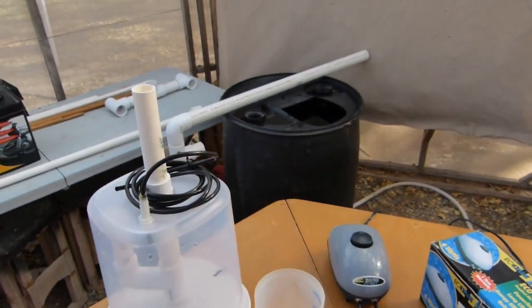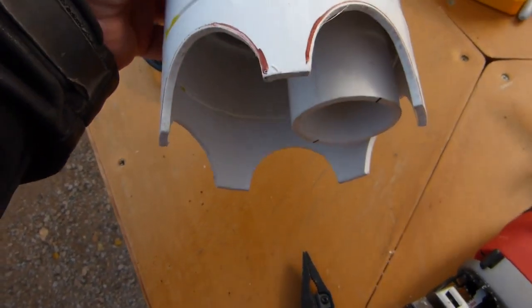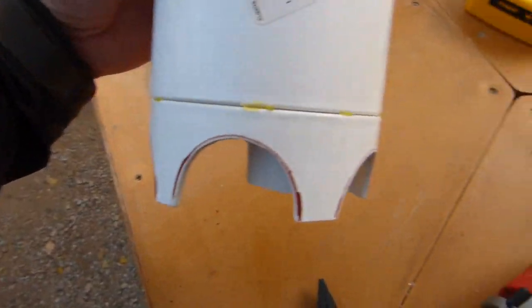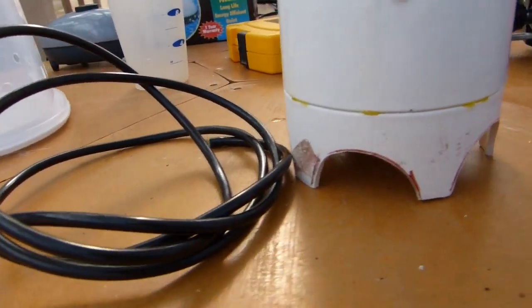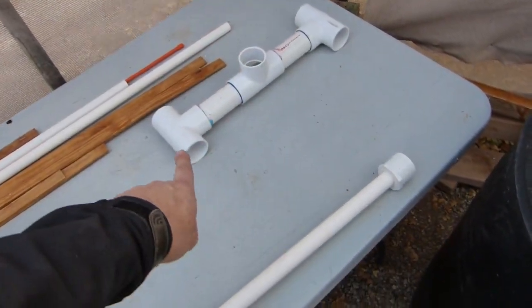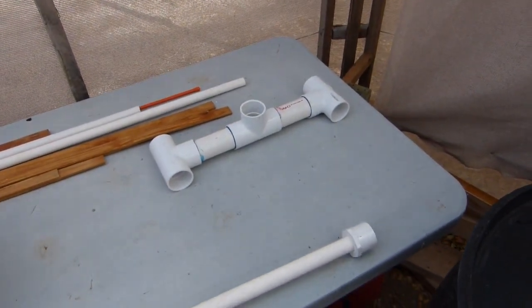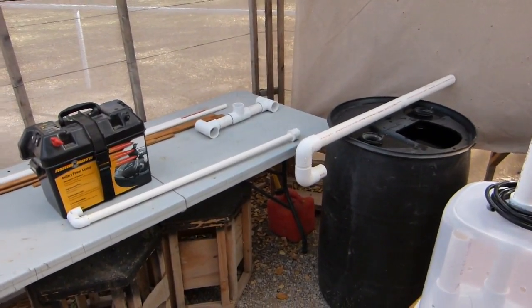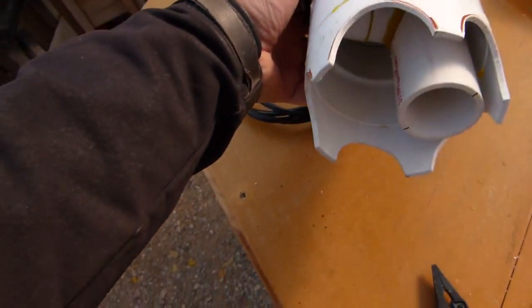When you're running it in a barrel like this, you've got to get the inlet as close to the bottom as possible, but not too close. I've got a little bit of clearance for the water to suck up inside — that's about perfect. I trimmed this coupler pipe to make it stand like that so you can get water going in all the sides. I tried attaching this to the bottom originally, but it went down to eight ounces per pulse. You could still use something like that if you needed a really stable base, but know you'll probably need more air. This one's perfect.